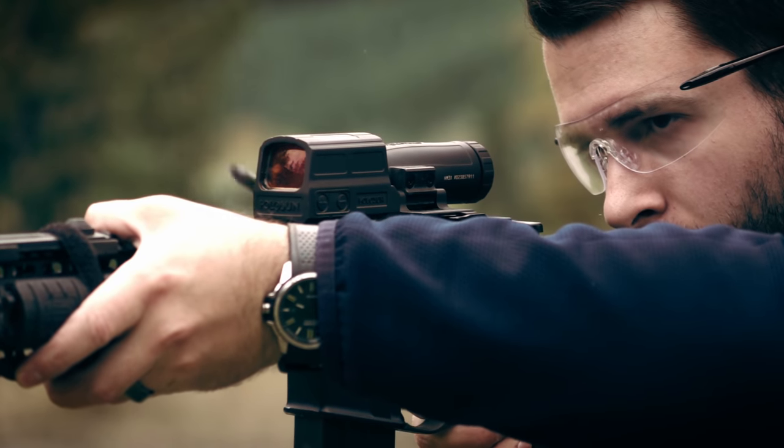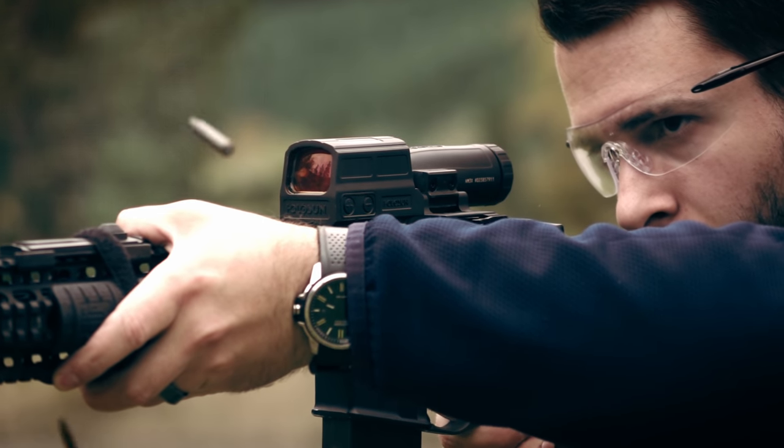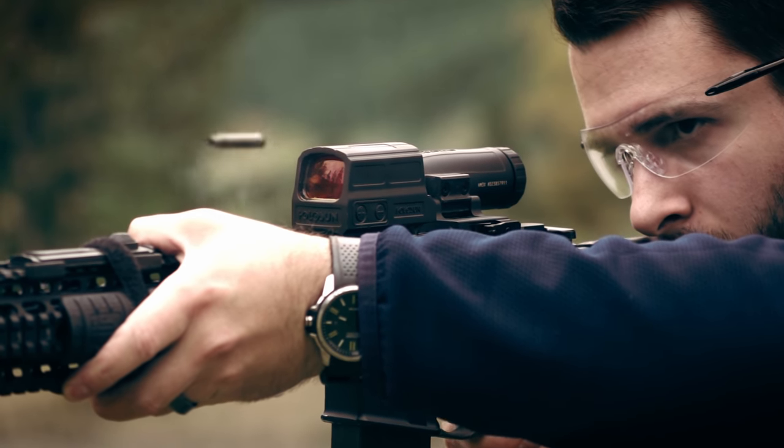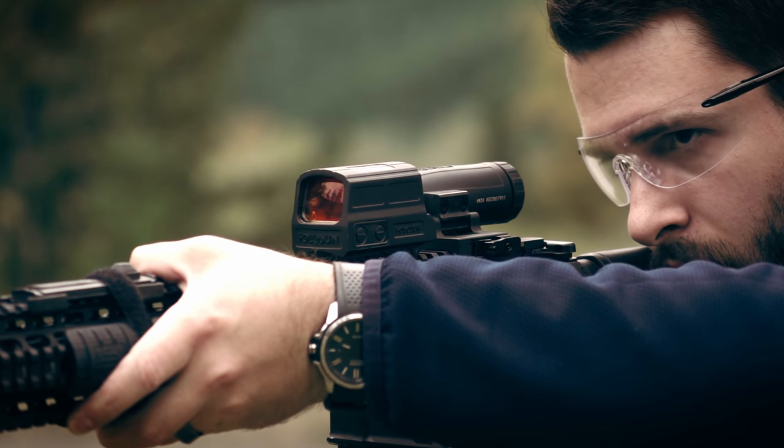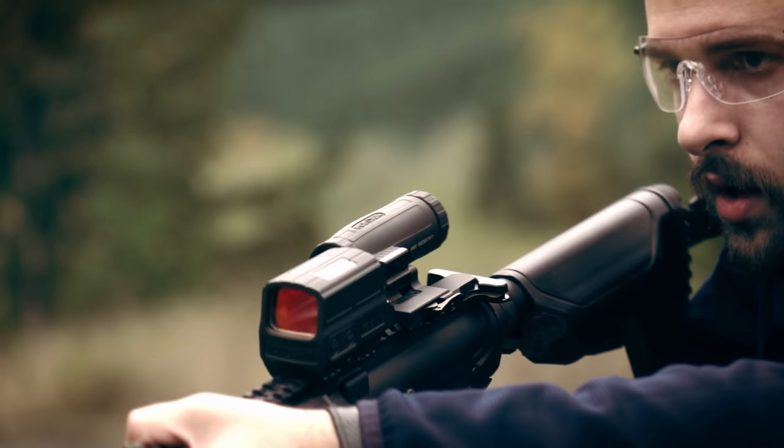But if you do order a Mark III upper receiver in the future with a 13.5-inch quad rail, they will of course have the anti-rotation tabs built in that slip over the upper receiver. They have a very, very tight tolerance. There's still maybe a half degree of play left or right between them, but that's just to make up for different size receivers, because there is gonna be some variation in receiver sizes as well.